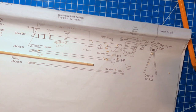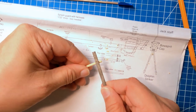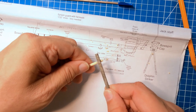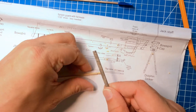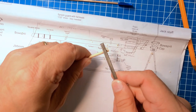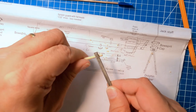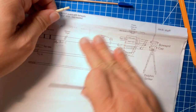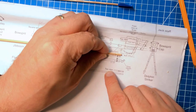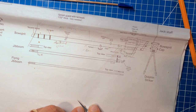Finish it off. Let's see if I can just get a needle file here and round it up. The needle file I'm using here is not cut on the sides. The sides are smooth. So I'm not actually cutting back this way any. I'm just smoothing off that taper. Looks pretty good. Next is, there's a notch on the end, but it looks like I can just take and shave off just a hair of this.